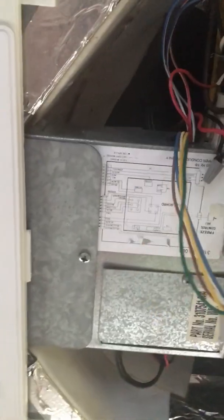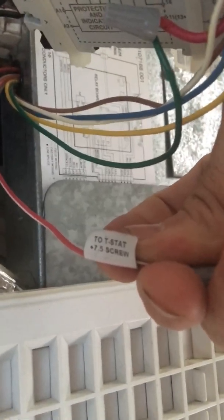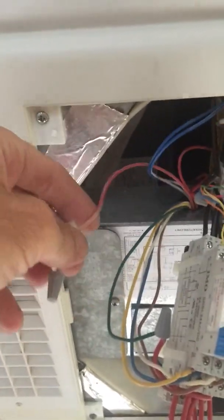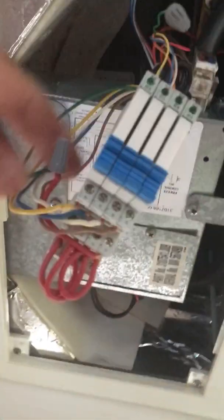The wire that you don't use is stuffed up here. That's the seven-and-a-half-volt wire that used to go down to the thermostat — it doesn't get that anymore. This was simply to run the thermostat, which needed seven and a half volts just to operate itself. So I no longer use this power coming out of the AC unit — I just capped it off and tucked it up out of the way.